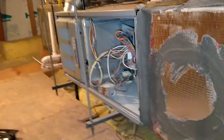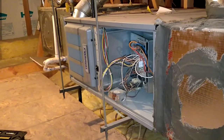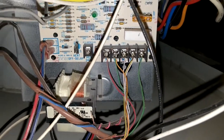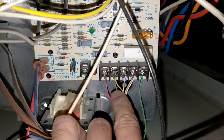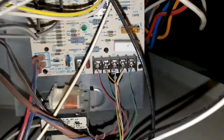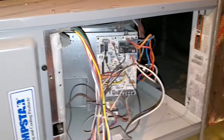I'll wire it up here and put a little tag on it downstairs saying 'this is your C wire,' so if anybody ever buys this house and wants to use it they don't have to come up here and rummage around. There is my orange wire on my downstairs unit now wired in — you can see it right there next to the green wire that was already wired in.